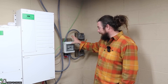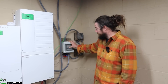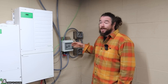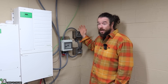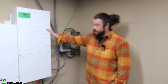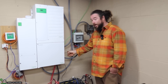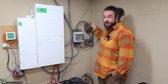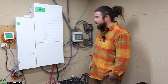This is a DC breaker in order to cut power, which is necessary for safety. This here is a Midnight Solar surge protector — in case I have a lightning strike or any sort of surge outside the home, it protects this expensive piece of equipment. Quite necessary. Coming out from this system, I also have a ground rod with a bare copper wire hammered 10 feet into the ground outside. This is all attached — very important for safety.